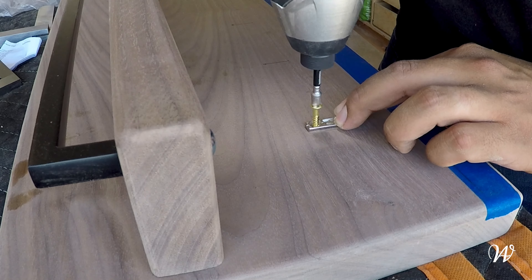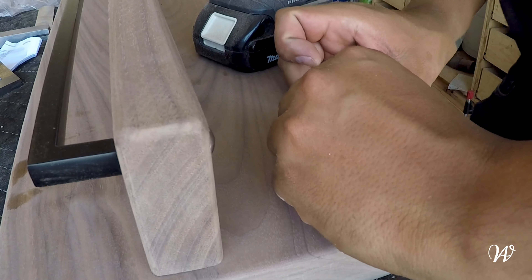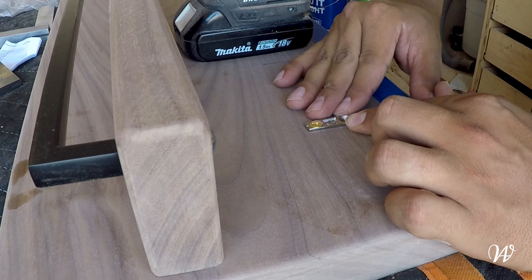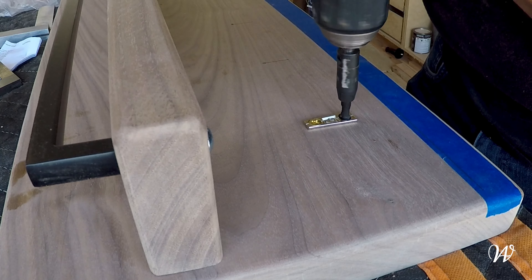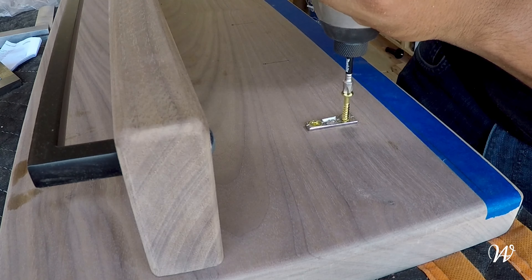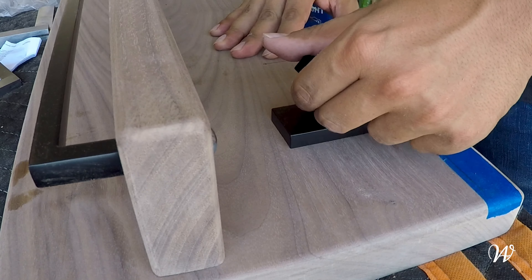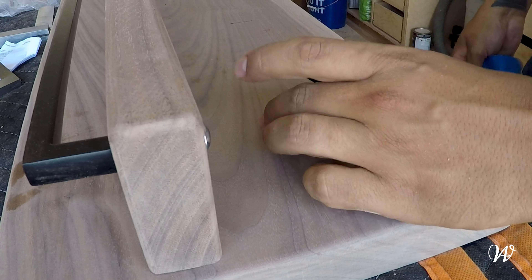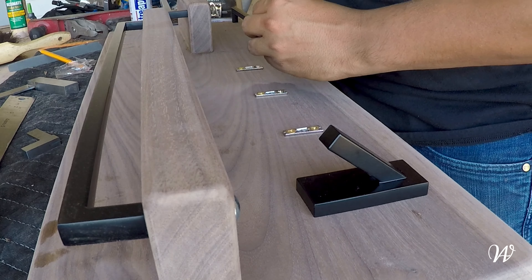I got these nice, easily removable hooks. I didn't like the screws that came with them, so I had to add my own because the other ones would have gone all the way through the piece and we can't have that. I placed one, made sure it lined up nice and straight with my reference line, grabbed a self-centering bit — because this can save your life when you're trying to add hardware and keep it nice and square without moving side to side — and then drove my screw in. These hooks were actually really cool; they just slid right onto that little mount and that's it. After that you can just pop them back up to take them off, which I did for the finish — didn't even have to remove any of the screws or mounting hardware to apply my finish, just applied it around it.